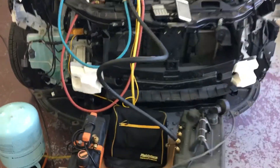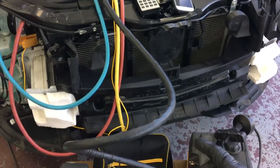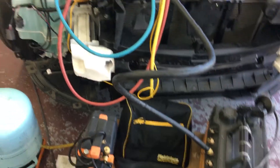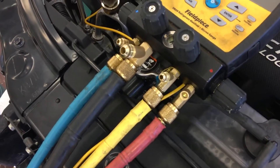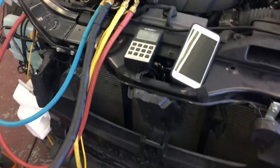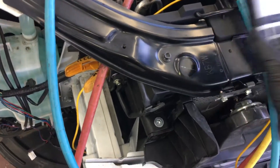2018 Mazda CX-5 — this was the one I did a recovery on several days ago and I'm about to recharge it. Our outside temperature is 94 degrees right now, 94.7 degrees. About to charge this — 500 grams, have it on the scale, wireless Bluetooth. Let's zero it out. I already checked its accuracy, it is working.